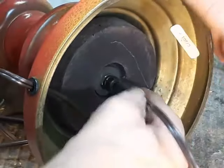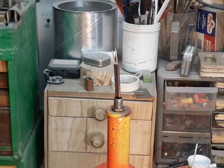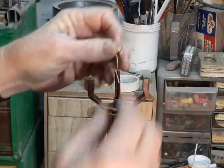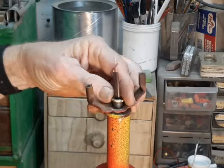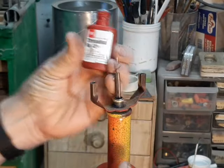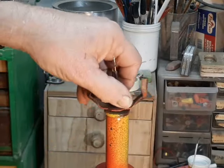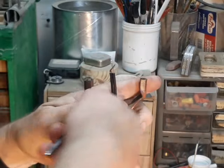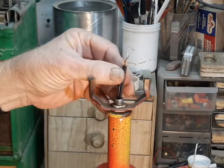Then, with a simple lamp like this, you can push the wire all the way up to the top. Now up here is where the important stuff happens — because if you do this right, you're going to have a lamp; if you do this wrong, you're going to have a hazard to life and property. I like to put a nut on top of the harp and then put a little of this blue thread lock so that when I get this tight it will stay tight while somebody's changing the bulb, and I don't have to tighten it with my ignition pliers until it screams. It's entirely possible to strip these things out if you try to get them really tight.